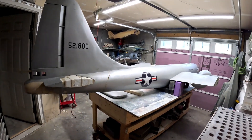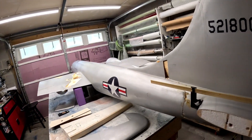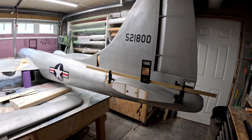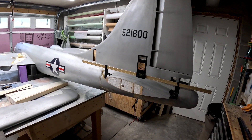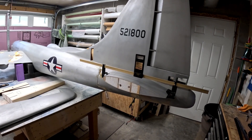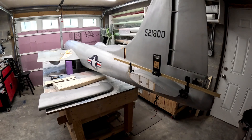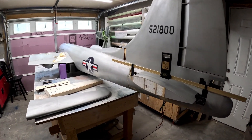The first few videos are really going to focus on making permanent stabs removable. This is significantly easier on a foam core airplane like this, because you don't have to worry too much about losing the shape and trying to peel sheeting off a built-up structure, where it's likely going to damage the ribs just as much as the sheeting.